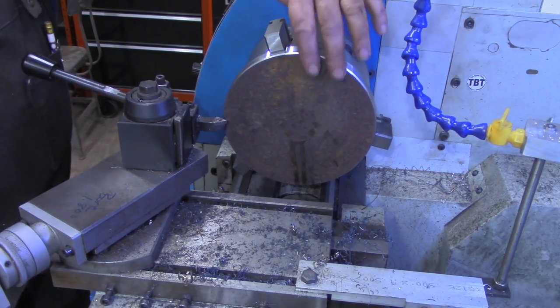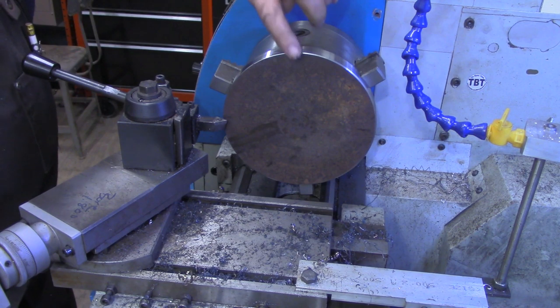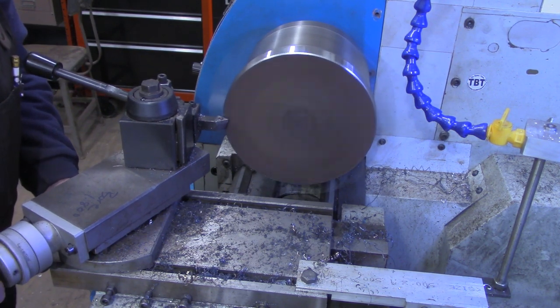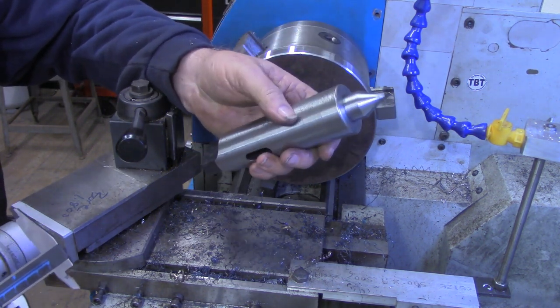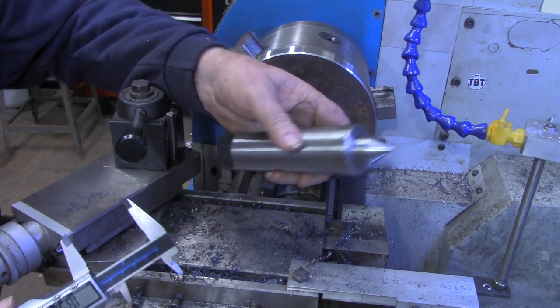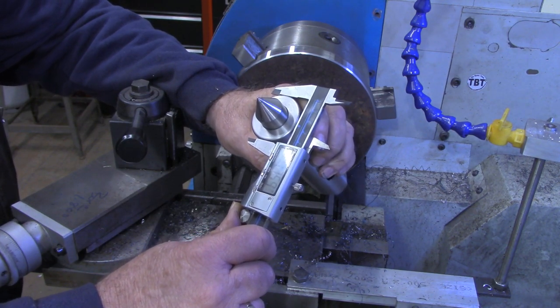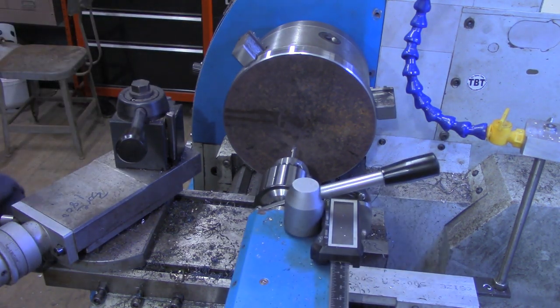I got the glue broke loose and got the piece off and got it in the chuck now. Got plenty of clearance around here. What I'm going to do first is just put a little chamfer on this edge — not the final chamfer, but I just want to get a little bit of that cleaned up. Now what we're going to do is drill and bore. The sleeve that goes in my spindle is two-part — it's a 5MT adapter down to a 3MT. That's one of the reasons this sticks out so far from the spindle. And that is 1.759, so we're going to bore out to about 1.8 inches, just so that clears through the center hole we're about to make.